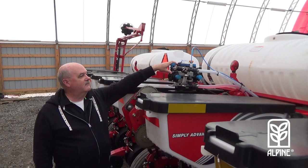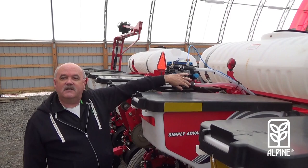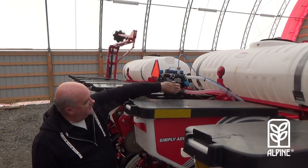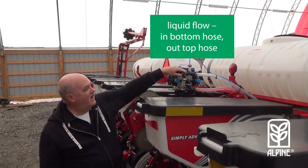When we're looking at the pump, there's one thing we'd like to start with at the beginning. I like to see a strainer in front of the pump. This particular strainer is mounted underneath the tank, but it can be mounted on the input of the pump. This pump flows in at the bottom and out at the top — so that's very important.